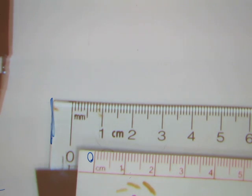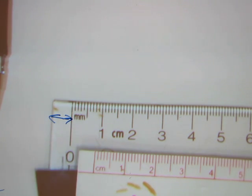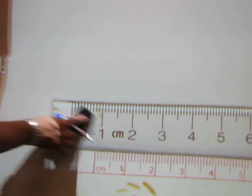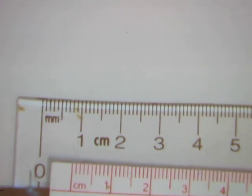But if you have a longer tape measure where the hook needs to be considered differently, it is a similar issue. The edge of the ruler is not where zero is, so don't use the edge of the ruler for measuring. Don't include that portion of the ruler into your measurements unaccounted.